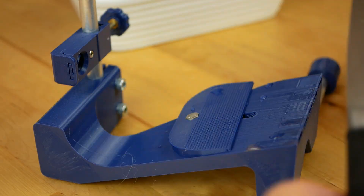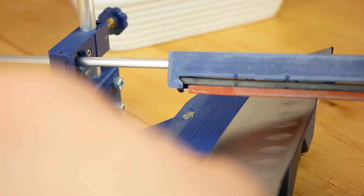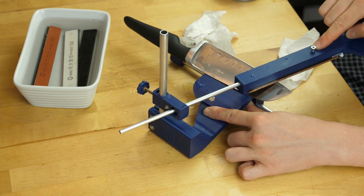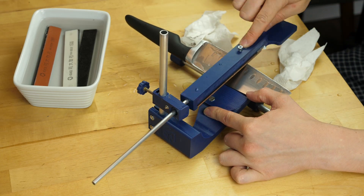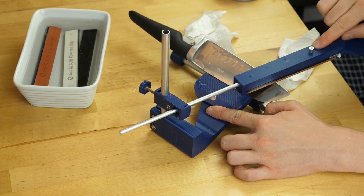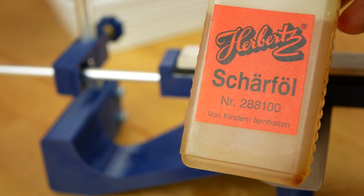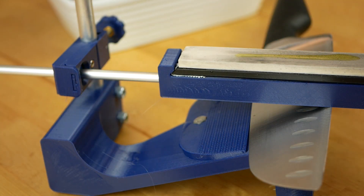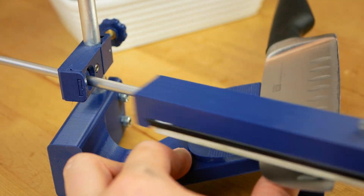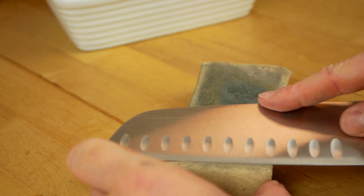Proceed with sharpening as long as you can still see a bit of black marker on the edge. When you have reached the edge, perform the same on the other side — for the first grind this can take quite a bit. Next we go successively through the other grits. I used 180, 400, 1500, and 3000 grit for this blade. Always make sure that the stone is properly wet and remove the residue only after you have finished one side, because the particles act almost like lapping paste. The finer grits only need a minute or two. To be safe you can again use the black marker trick. For the last step with the 3000 grit stone I even used sharpening oil to get the best results.